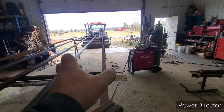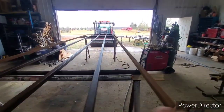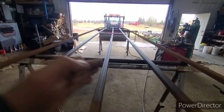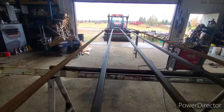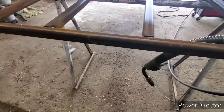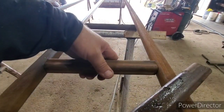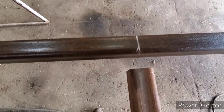When they pull it off the coil, the guy squashes it into a square, but it's not perfectly straight. If you look you can see a bow - this one has a bow going the other way, this one has a bow like this. So I've got to pull them a little bit, tweak them a little bit to get those straight. This bar fits inside of my top and bottom, same on the other end, and then my other three bars are inside of that. We just cut these pieces to fit in here. Brennan, you cut it too short - no I didn't, it's because it's bowed, so we've got to pull them.